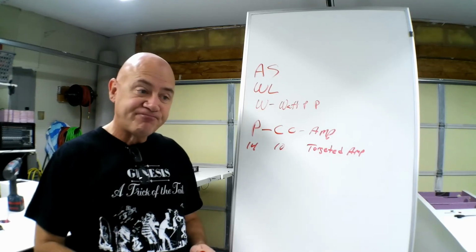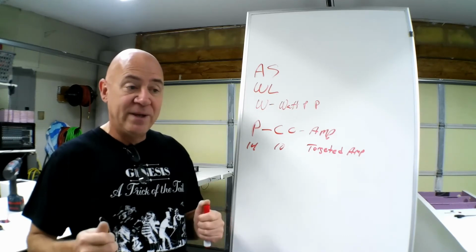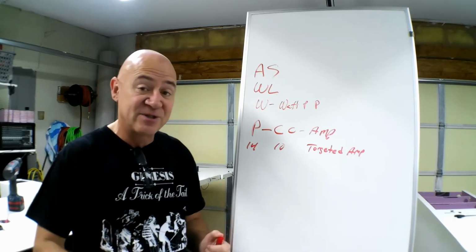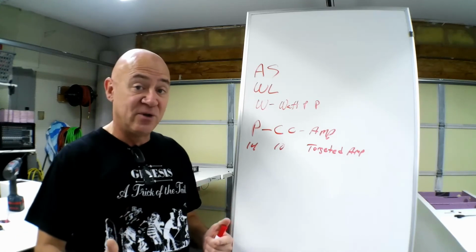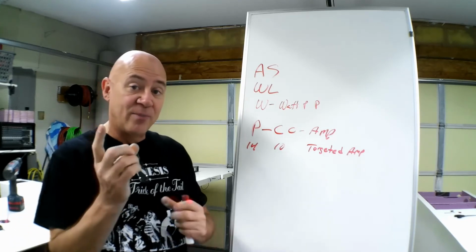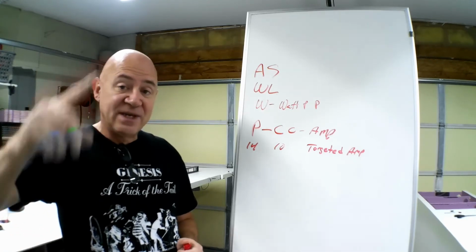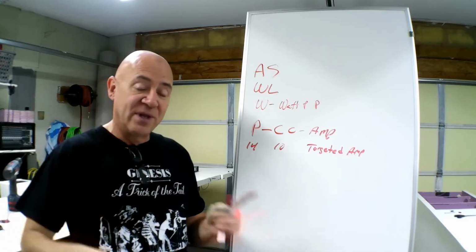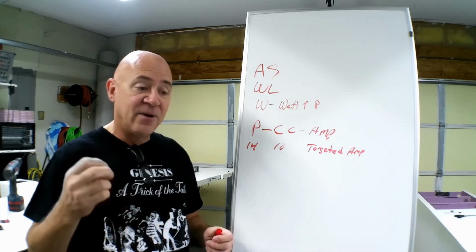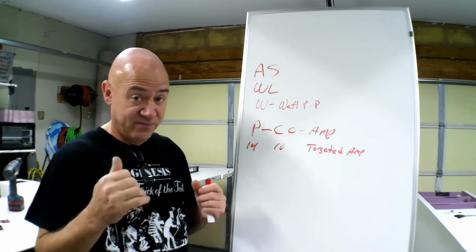On electrics, it's a little bit different. You want to turn the prop at the slowest RPM possible, pulling the airspeed you need through it, because props are more efficient at lower speeds, because you know drag is squared. The most efficient propeller is a one-bladed prop with a counterweight on it. And they're out there. Look, Google it, one-bladed prop. Because it doesn't create as much turbulence, there is less turbulence that the blades are following through as it goes through the air. For me, I love 3-bladed props because of the look, not their efficiency, but they're 14 pitch.